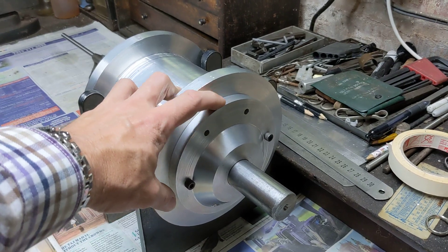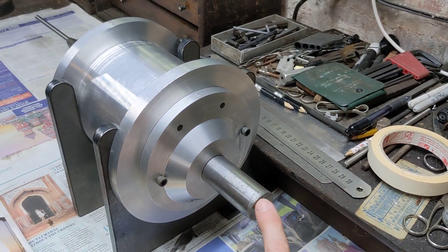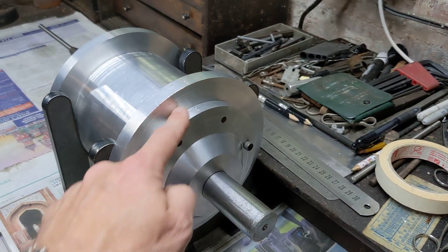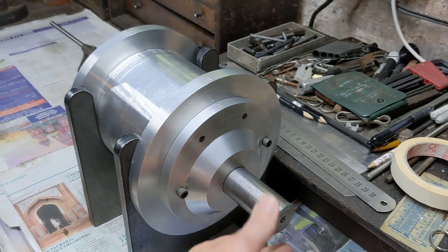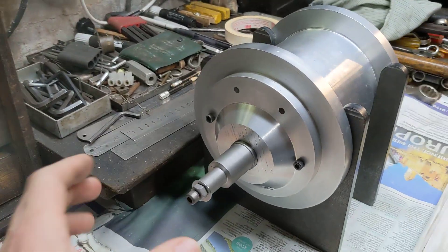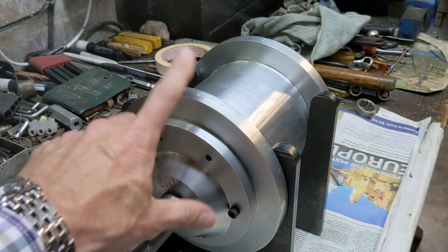That's no mean feat because this mandrel here is a beautiful fit, and it will only fit if the centerline is concentric between this side and that side of the gearbox case. But this actual hole for this shaft isn't concentric with the center of these plates, so there needed to be some careful jigging out to make that a nice fit. So we've got this dummy shaft in, we've got the gearbox case drilled and tapped, and that's great.